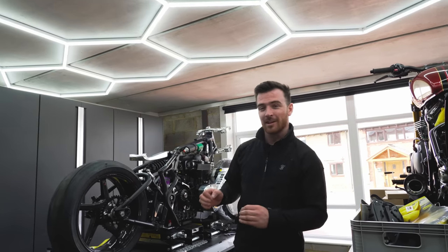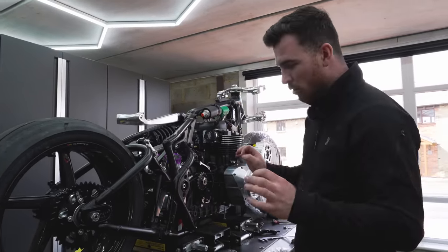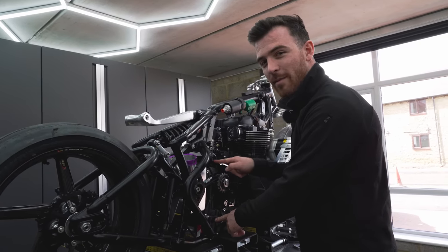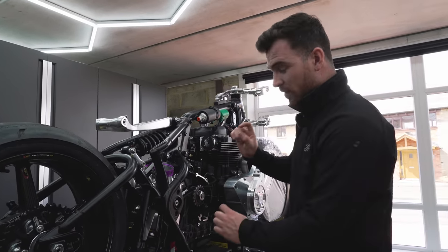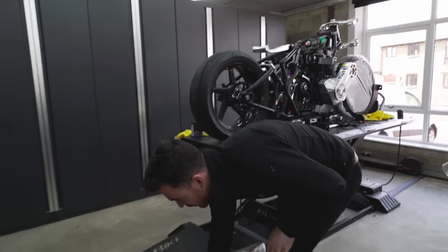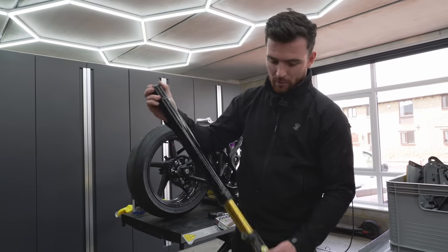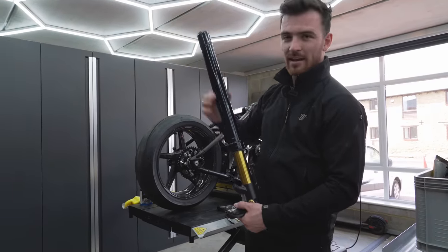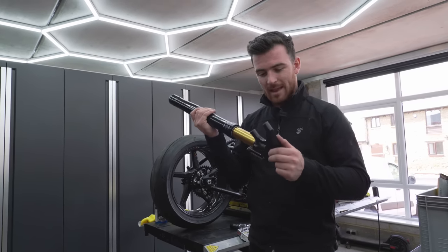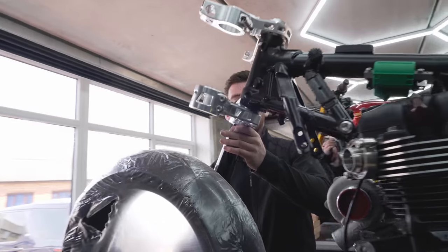The WFB is really starting to come along now. The fuel pumps are in, the coils, the plenum — everything is just loosely bolted up because I've got to spec the titanium bolts. I've also commissioned these two bolts here to be made out of titanium as well — they're very visible bolts and they'll look really cool with the TH logo on the end. In this box I've just collected the forks — these have been completely custom made for us. They are Öhlins forks with a load of adjustment on the top for compression and rebound adjustment at the bottom. We've had the top polished and coated in black, the stanchion titanium nitrided in gold, and the bottom foot Cerakoted in matte black. They look so smart.